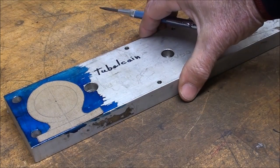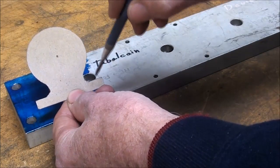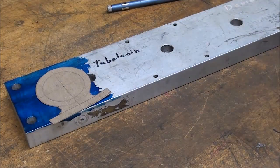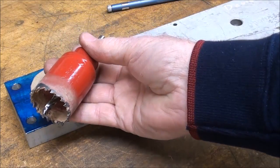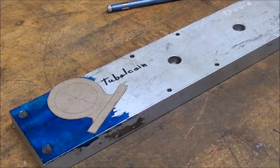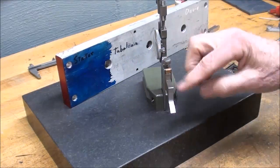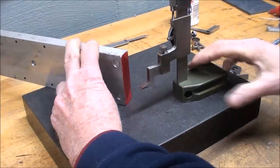Now the whole idea is after I lay this out I need to start machining, and that can be done in several different sequences. I intend to cut it out, saw it out, then form the outside of the stator, and then put it back either in the mill or the lathe — I haven't decided yet — and bore this hole. In the wooden one I used a one-and-a-half inch hole saw, but I just don't care for hole saws in heavier material. They have to be run at a very slow speed.